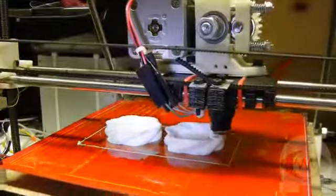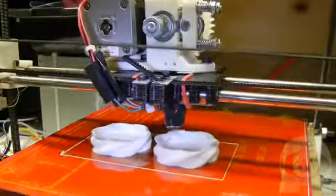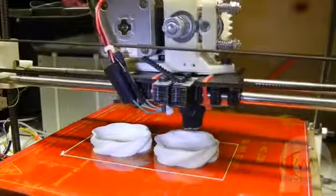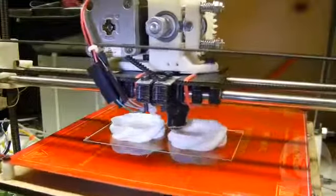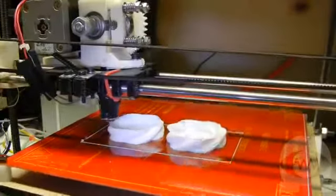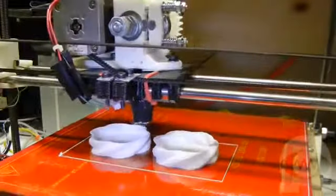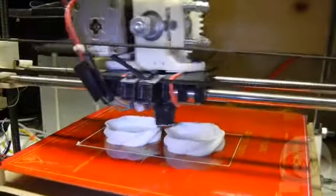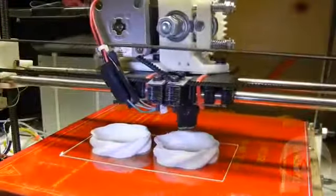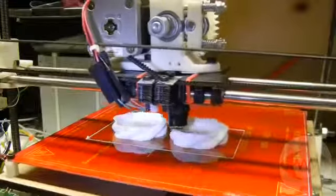With PLA, once the print gets going and is several layers in, I like to turn the heat off so the bottom of the object doesn't get as much of a melted consistency that makes it look different from the rest of the object. Once it's past the initial sticking stage, most PLA objects stay stuck to the bed without the heat. Also, with PLA, the heat from the bed can cause fine details to warp depending on their shape and how close they are to the bed.